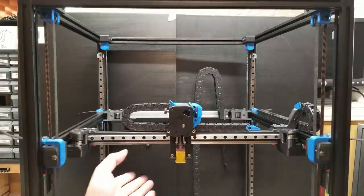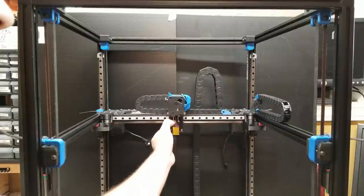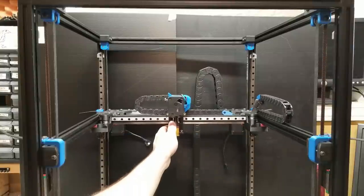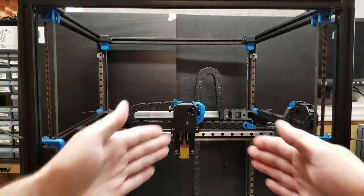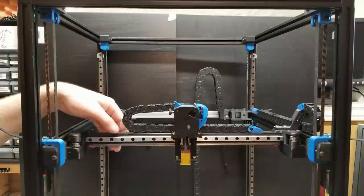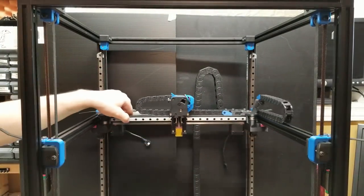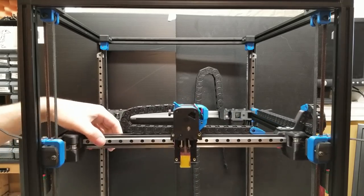You can do this with a tape measure. However, I found the easiest way is to simply move your X carriage back and forth. If it moves back and forth smoothly and evenly, odds are they are parallel to each other. However, if you find some resistance, specifically more towards the back, that most likely means your rear cross beam is either pushing out or pulling them in. The easiest way to fix that is to loosen the screws that attach the rear cross beam to the AB motor mounts, then move your X beam around until everything finds its natural home.